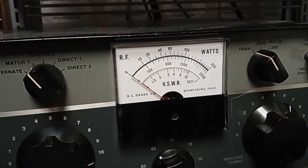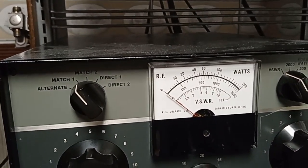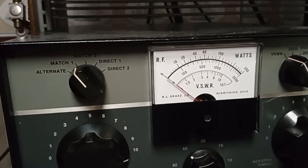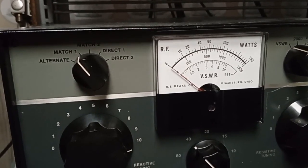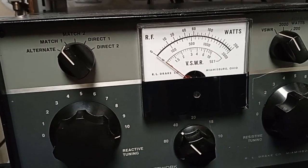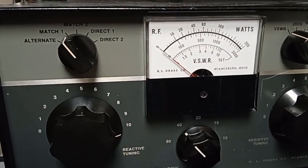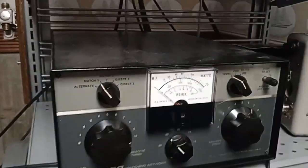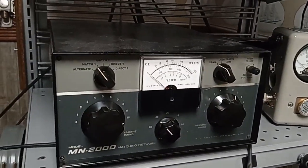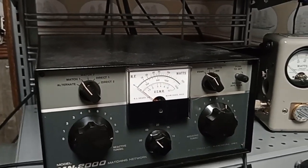It's a thing in CB radio of pretending that the system will match better if transmission line is added or removed to make the SWR go down. But that's fooling themselves. All that's doing is moving the minimum in the current and making the meter coincide with the minimum. SWR meters don't read SWR — they read reflected current. So this meter is indicating a minimum in current, and what this so-called tuner is doing is fooling us by artificially making a current minima, making us think it's matched. Now the radio thinks it's matched also.